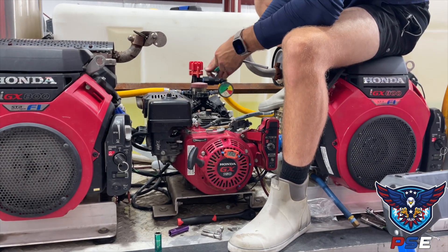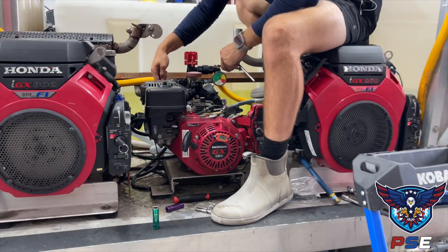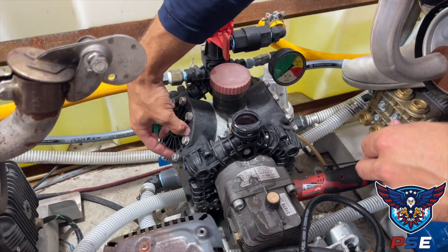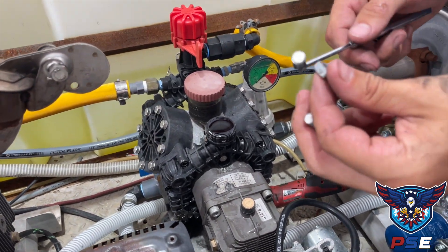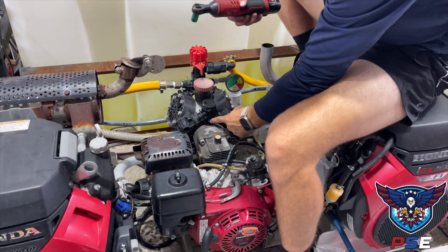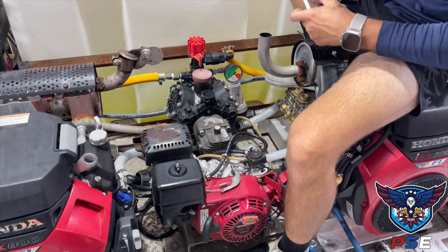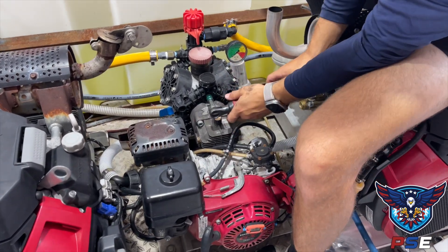When you pull out the bottom two bolts, these keyways are going to come out — they sit in the pump head. There are four little slots on each of these pump heads. You have three heads: two here and one on the bottom. The two nuts that hold into the head fell out, so you're going to need something to push it back up into that slot while you screw it in. For the last three bolts on the main part of the manifold, the extension is going to come in handy — it gives you more room so the ratchet head doesn't butt up against the gearbox.